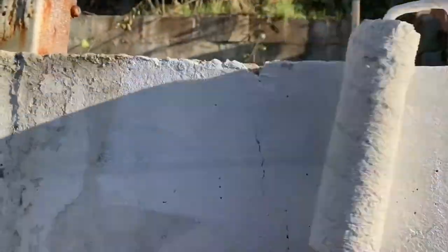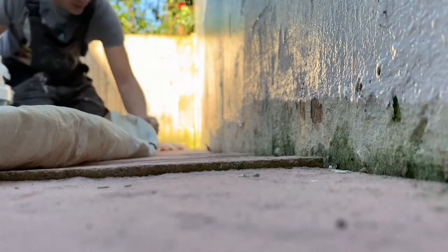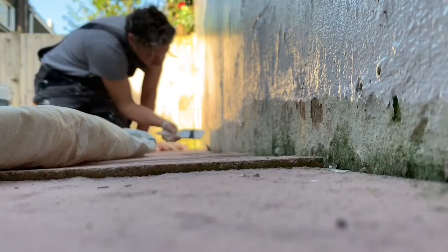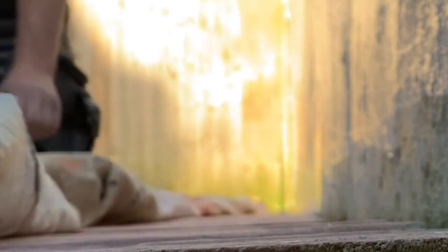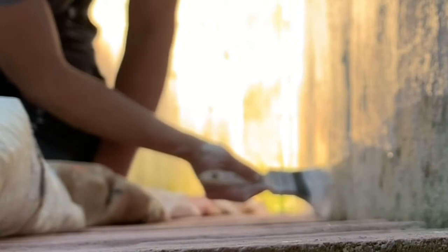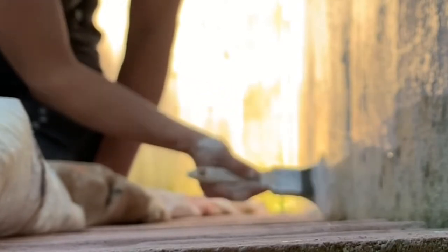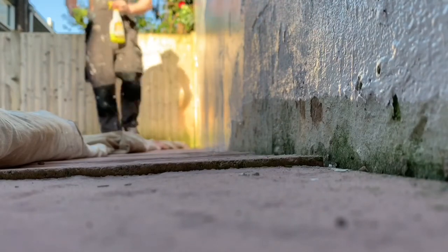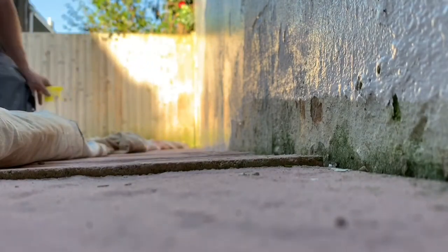Let's get that wall finished. You can see how thickly I'm dumping it on — it's a masonry paint, it's got to get in all those cracks, gaps and holes. Getting down to that bottom edge now — we've done all the wall above it and we haven't got to worry about the roller flicking and spraying anymore. So now we can move the dust sheet away from the edge of the wall and start cutting in. Take your time, nice and slowly. Move the debris out of the way, keep the brush out of the mud. Place it against the wall with a little bit of pressure so it fans out and you'll be able to get right down as close as you can, not actually touching the muck. If you make any drips, drops, splats or splutters then clean them up straight away. It's a masonry paint and it will stick to anything — slabs, concrete, brickwork. Once it dries it's difficult to move, so get it done straight away.